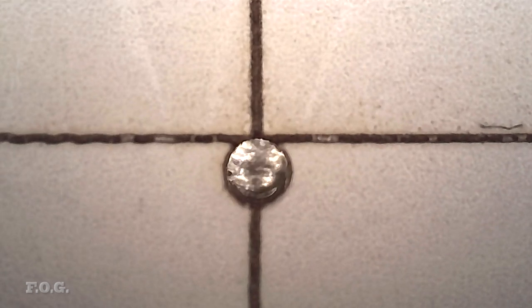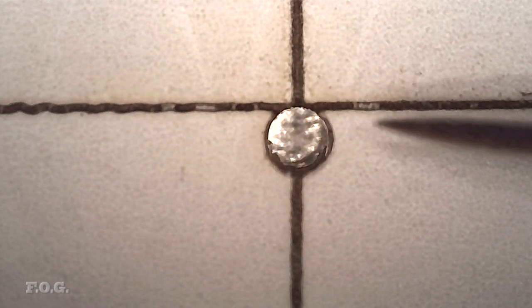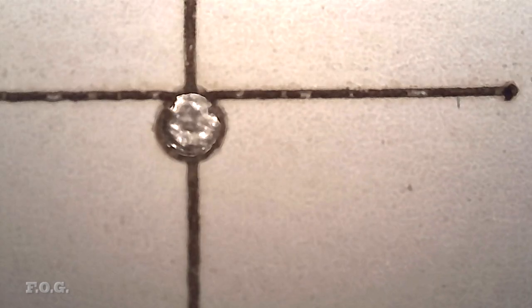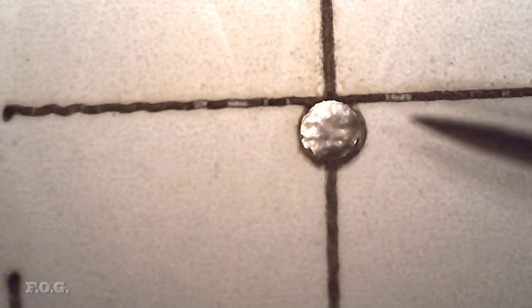This is the pre-alignment one that I've done here, and you can see the mill is quite a lot below the laser here, and the top of the mill here is really on the center line. And if we look at the next one here, we're actually a little bit above the line. So this difference, which is maybe around 0.05 millimeters, is the play in the XY axis of the CNC.